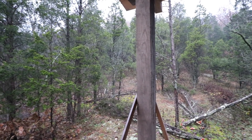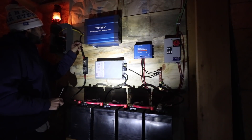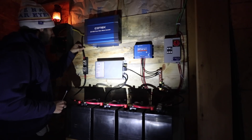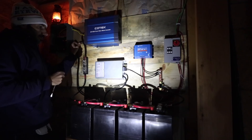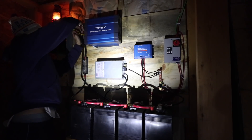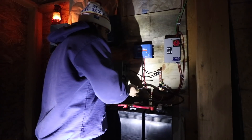Day 2 here, got a little cold last night — so this will be day 3.5 of working on solar, hoping to wrap it up today. Now I'm finishing the positive connection to the inverter. That gray box in the middle is the Iota DLS27-40X battery charger, which will allow me to charge my battery via a generator for days I don't have good sun. Now I'm connecting the inverter negative to the negative bus bar, and the shunt is right below that, which measures all the current in and out of the battery.